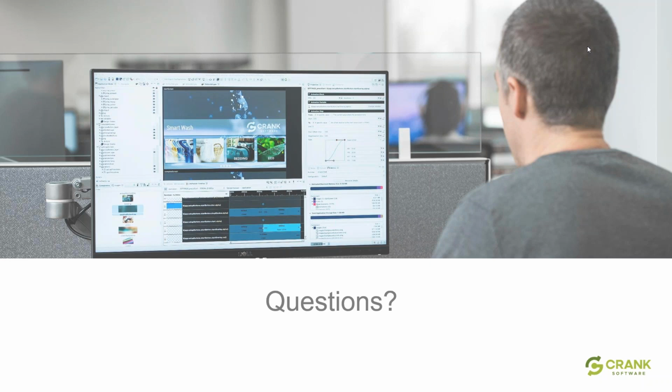But in the case of the real-time executives, so I'll say FreeRTOS or ThreadX or bare metal, we require a few minimum things. One is the ability to dynamically allocate and free memory, so a heap_3 memory style configuration. The other is we need to be able to create a task, assign some priority to it, and then also have some synchronization primitives around that, so mutexes or semaphores. And then finally, we need to be able to create a timer. Timers can allow you to drive animations or do some interesting behavior at specific intervals. So those are generally the bare minimum.